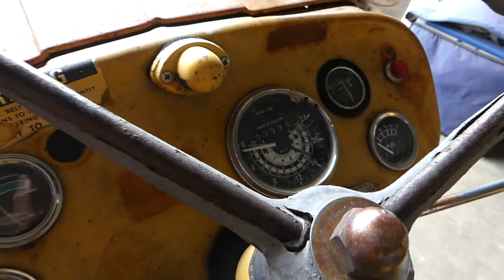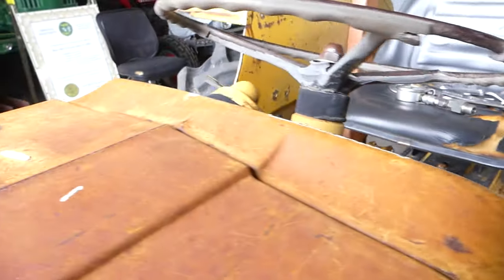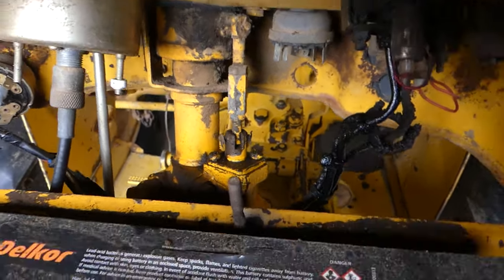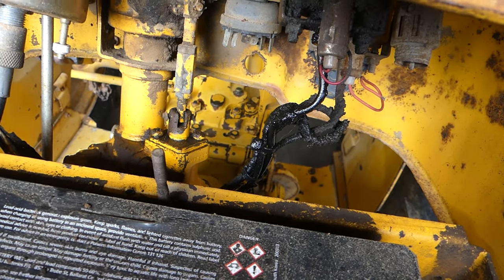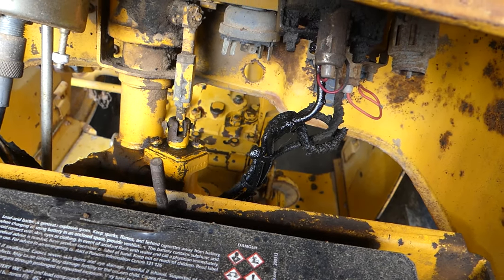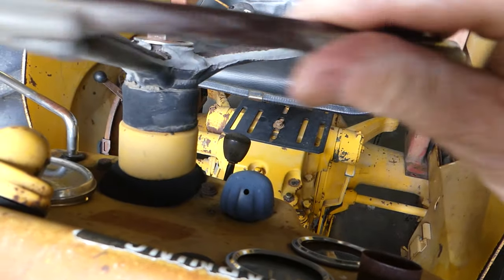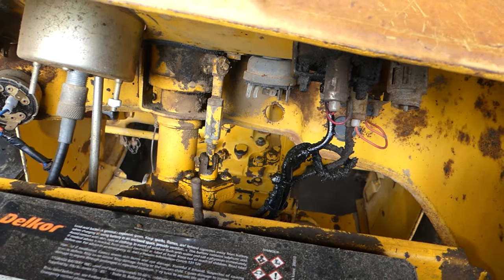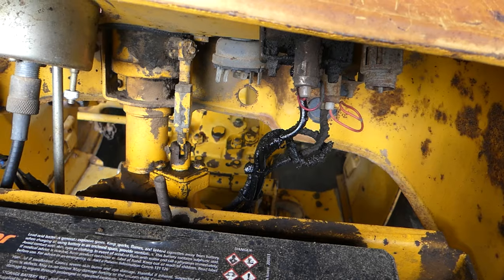The dash isn't too bad for what you can see. With the pre-cleaner here — we'll pull that out and pull this plate off. Now down inside here, this valve here is the power steering valve on these, and it feels like it's travelling all the way. They only move a little bit and it's equally poor steering both left and right, so that's working. You can see the column on the dash goes up and down — that's what works this valve — but there's just no power steering at all. I'll be keen to get that going and have a bit of a look.